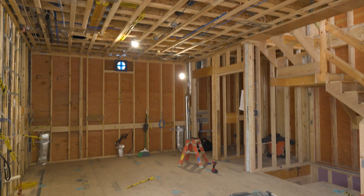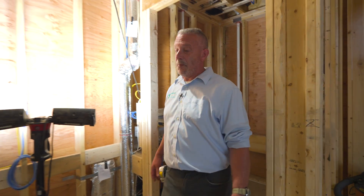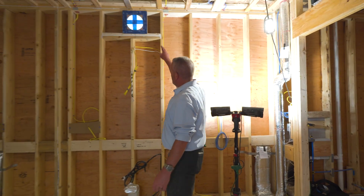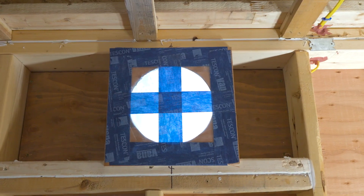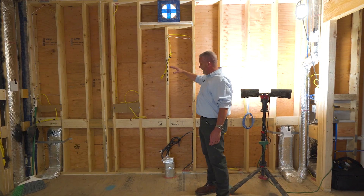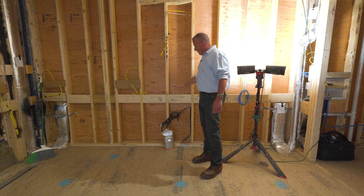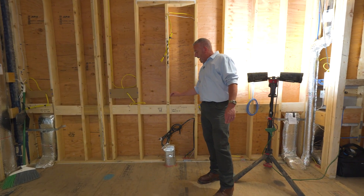This place is a super comfortable space to live in. Let's continue on the makeup air for the range hood. Over my head here, we've got the exhaust port, which will be connected to the actual range hood. It's rated at 300 CFM. Building science professionals tell us that two-thirds of that air volume should be at the source.